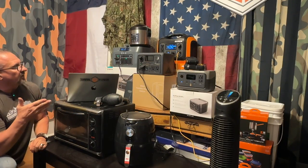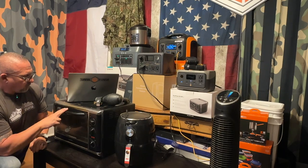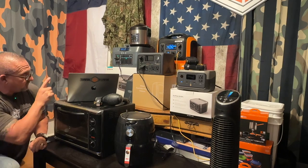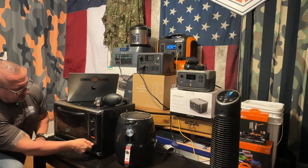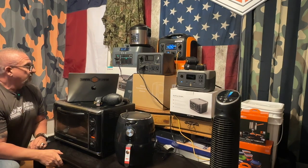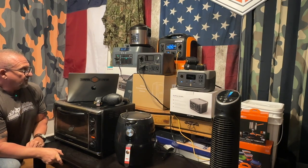Okay y'all, so we unplugged everything from the OUPES 1200. We've got this toaster oven plugged in now, which draws 1500 watts, 300 more than its capacity. Let's see what happens when we turn this guy on. It's on its highest setting, 450 degrees. Wattage is climbing heavily,